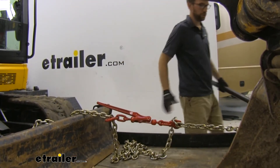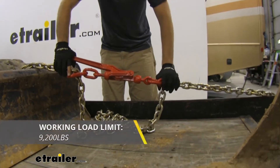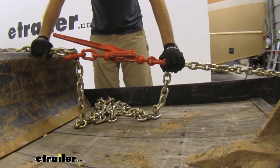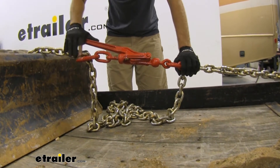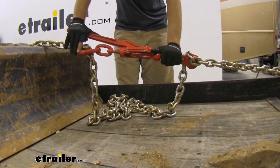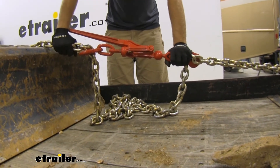Taking a closer look at it, you can see that it is really high forged steel. This has a working load limit of 9,200 pounds, which is below my chain's capacity of 11,300 pounds. So we need to go off that 9,200 pounds. Pairing this up with more chains on this mini excavator, we're going to be just fine. But go with whichever is the lowest between your binder and your chain.